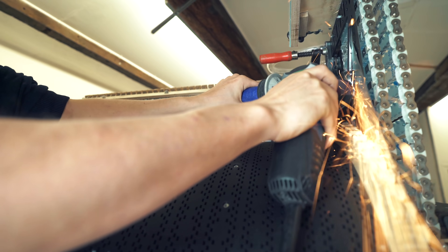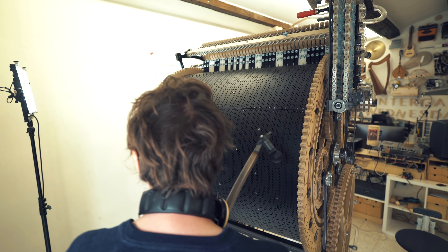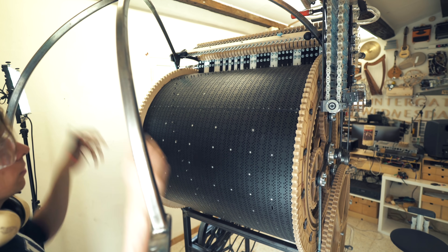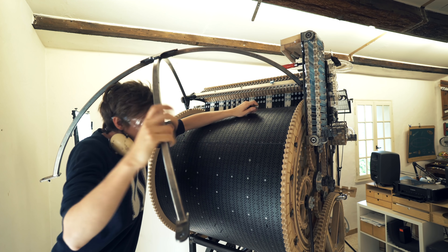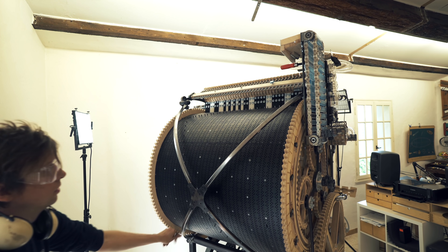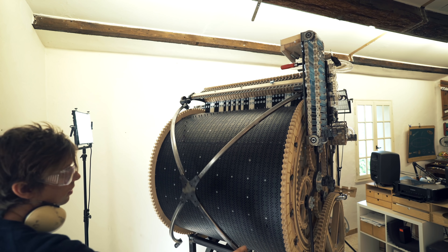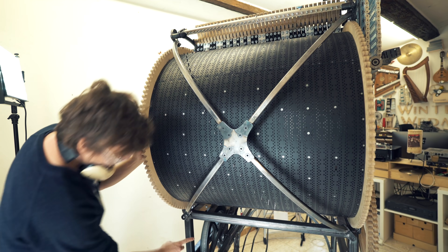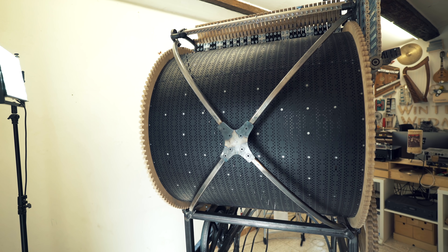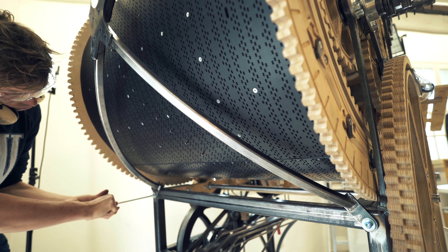Here I'm grinding away material to create a kind of ramp for the locking pin, so it can lock itself without manually being opened. To unlock the X bracing and put it down again you need to be two people, so I'm removing one of the lock pins so I can handle it by myself. When Marius designed the bottom of the X bracing he implemented a positioning pin, and that works great — so you can push the X bracing into place with a nice preload and then attach it with the bolts.